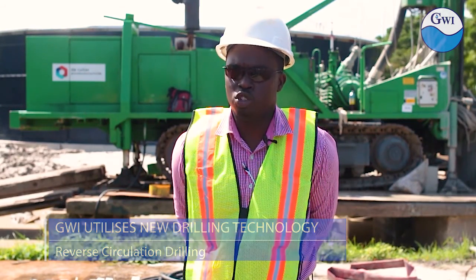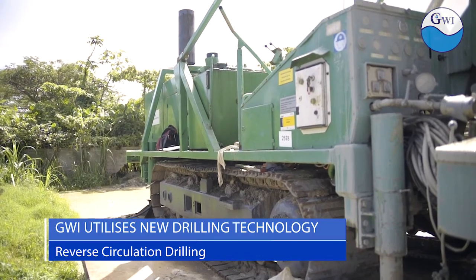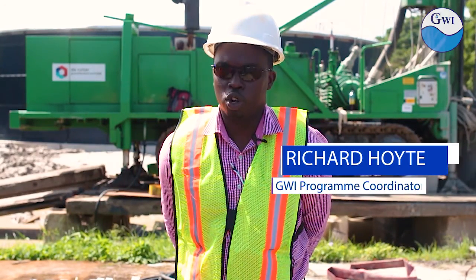We have drilled a new well to the depth of 233 meters, and so the production there has almost been doubled. The third and final well drilled by the Dutch company is located in Sophia. This plant is under tremendous pressure to meet demand in the community, so we drilled a similar well to the ones in Sparrandam and Diamond. This plant currently produces approximately 12 megalitres of water per day, and this new well will increase that production by another 4 megalitres, bringing total production to around 16 megalitres.